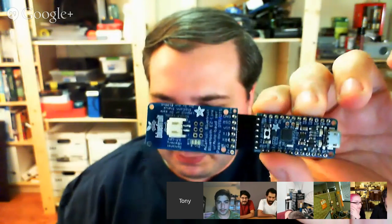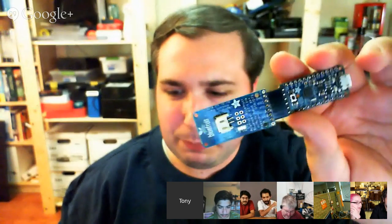It actually works. I just tested it out and was able to program the Pro Trinket wirelessly with the Bluetooth connection. I wasn't sure it would work because I think you're supposed to have a capacitor on the DTR line, I want to say. Oh, there is one. It's on the board. Oh, okay, perfect. So yeah, it's pretty slick.